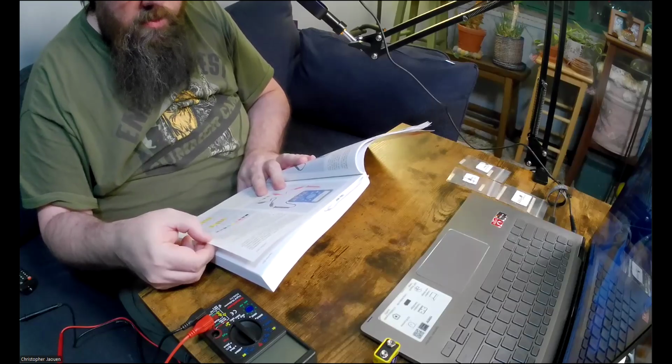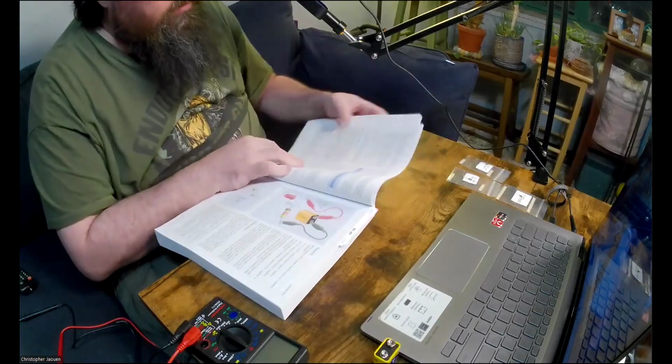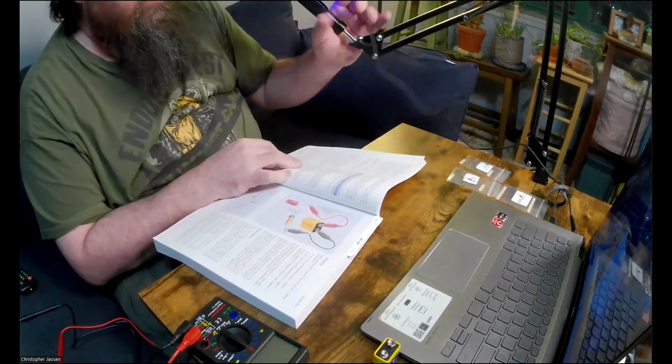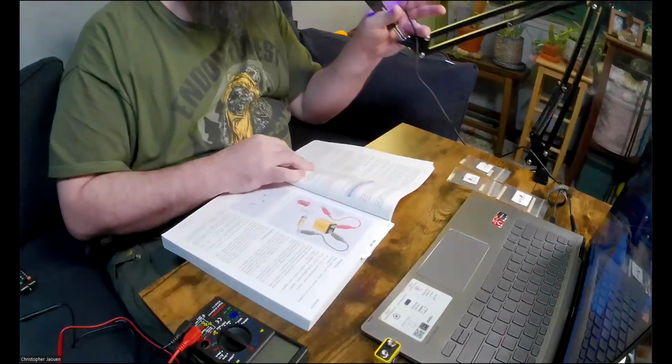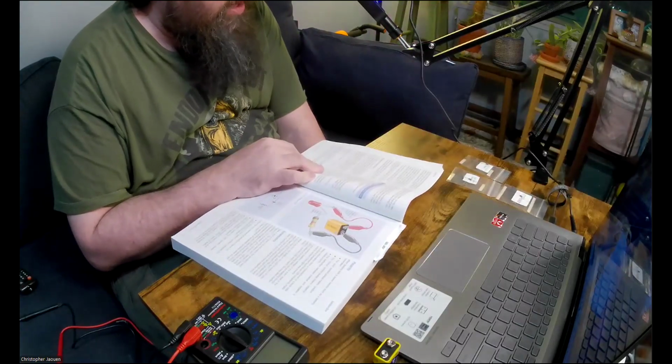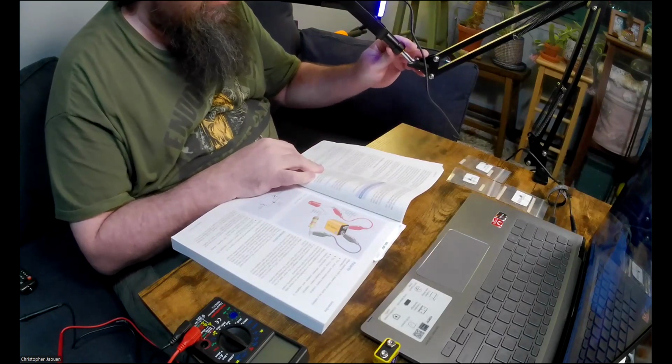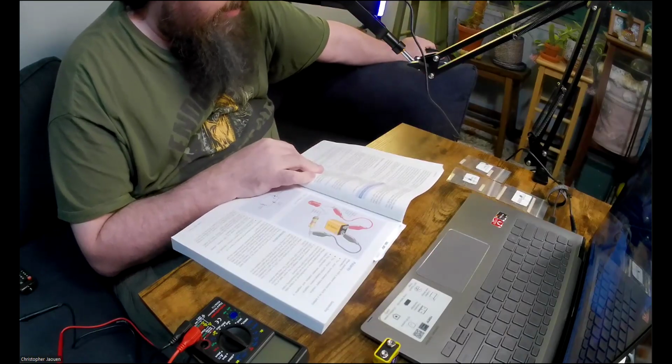Some resistors have a 1% tolerance, or even better, in which case they won't have a silver or gold stripe, and some other color will be used. So I'm like hunched over here. Let me move this back a little bit. Whatever it is, you will find a gap between it and the other stripes, this gap being wider than the gaps among the other stripes.